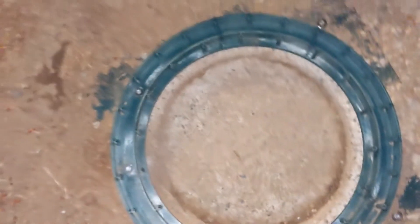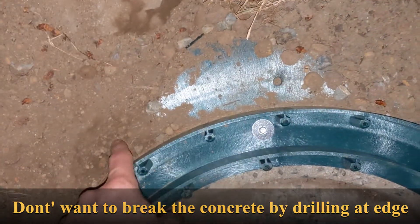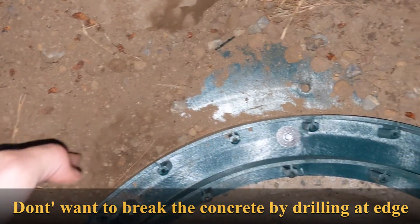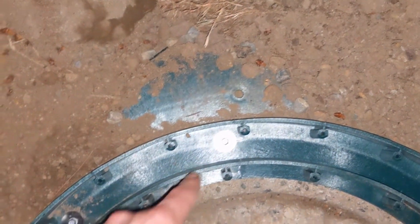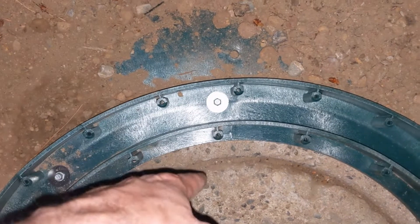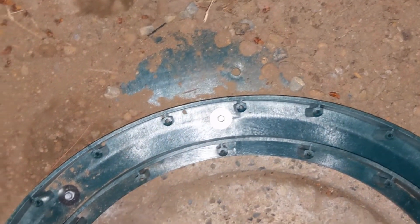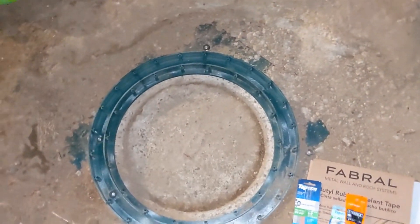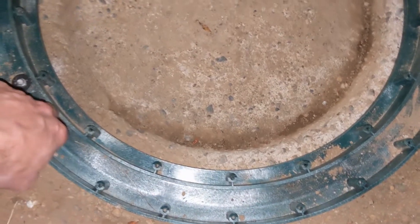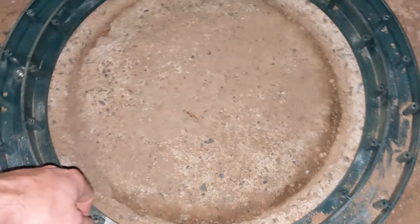On this side, these two screws are installed not in the original holes — the edge of the tank goes in here and they're so close to the edge I didn't want to use those holes. I installed them here instead, and since I'm using butyl around here this is still outside the envelope. Also stainless. Since this install is going to be winterized, I'm keeping this open for now and I'm going to use a polyethylene expanding foam — I'm in a colder environment up in the Pacific Northwest.